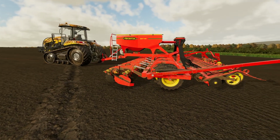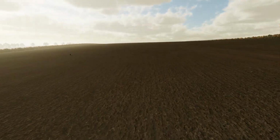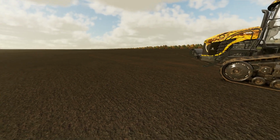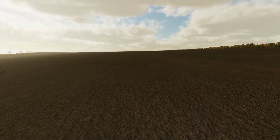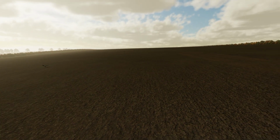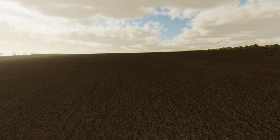And yeah, so a 12-metre drill would be more preferable than a 9-metre drill, just because obviously with 36-metre tram lines, it means that we will travel 3 times in between the tram lines and then on the tram lines, but those 3 times in between we'll be able to have them in exactly the same positions all the time, because everything else will then become 12 metres, so cultivators, seed drill and different things like that. So all of the things that we're then able to, combine headers, we will look for a 12-metre combine header.